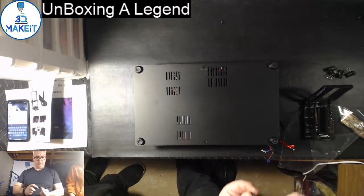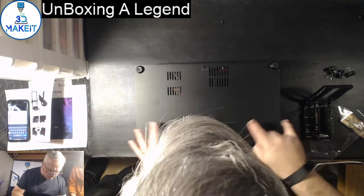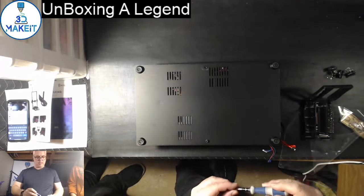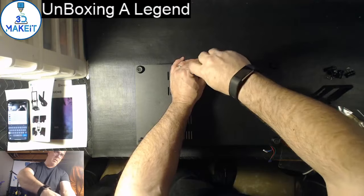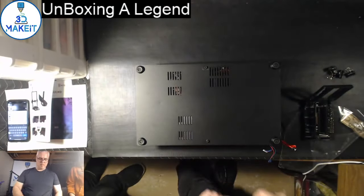One thing I'll throw out there about the electronic setup inside: most of it was good. I don't think electrical tape is a good solution for covering those spliced wires. Heat shrink would be better. And from other manufacturers, you would see that. But at the price of this printer, they would have had to make concessions somewhere.